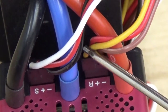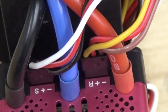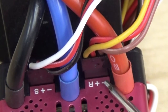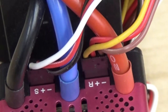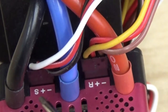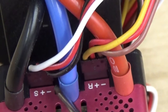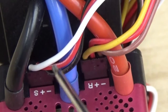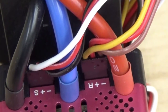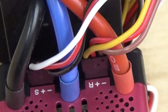The yellow wire gets plugged into the RPM input on the microbeast. So it's a single cable at the ESC end, but at the other end there's a connector with brown and red for power, and yellow is broken out as an independent connector for RPM. The other connector, marked minus, plus, S, is your throttle signal — it plugs into the throttle channel on the microbeast, providing power on red and black and the throttle signal to the ESC on the white wire.